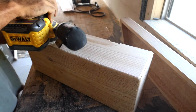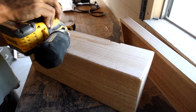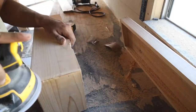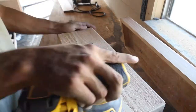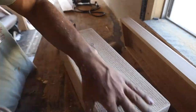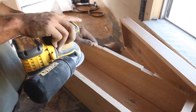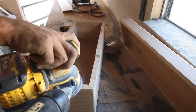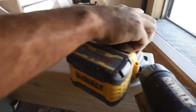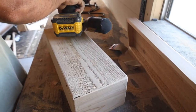Now I'm sanding this — I'm using 120 grit at first and then 400 grit, since those were the two that I had. I should probably diversify my sanding collection but until then this worked out just fine. While sanding I can get a closer look at the gaps between the edges and plan what to do — I'm probably going to put some putty on there.